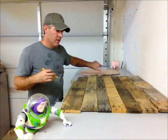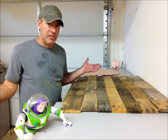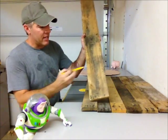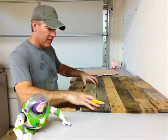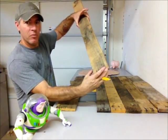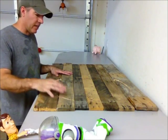I've got a pretty good trace line. All I need to do now is go to my bandsaw — or a jigsaw if that's what you have — and cut them out. I just cut one slat at a time, following my line. On some slats I'm going to lose a large piece and just end up with a small piece at the top — no problem.